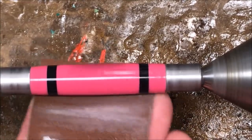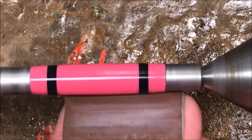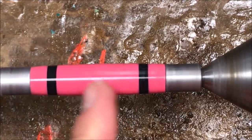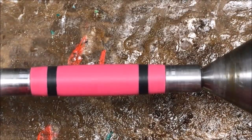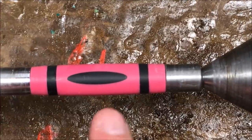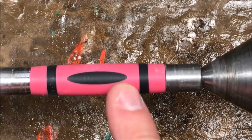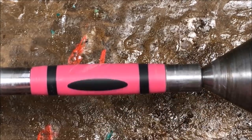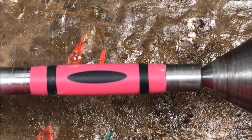I'm not going to make you watch this entire process — I mean you see how slow it is, it takes time. You just want to continually work the blank, get all the tool marks out, and as many of the fine scratches as you can see with your eye. I'll pull up to the black area and you can already tell a difference with the tool marks just from what little bit I've done. So we'll shut the camera off, finish micro meshing, and I'll come back and show it to you prior to buffing.